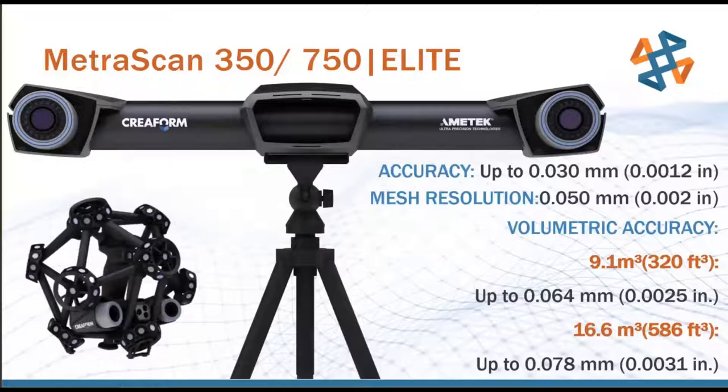The C-Track cameras that you see on the left and the right there observe the hand scanner and transmit that data back to the controller to say, okay, the hand scanner is positioned at location XYZ in space relative to my original coordinate system here. So the C-Track tracks the hand scanner while the hand scanner projects lasers onto the surface of the part to get that surface data. So the hand scanner acquires the surface data. The C-Track tells us where to put that surface data.